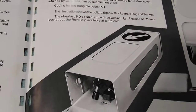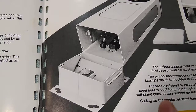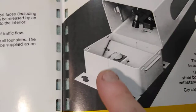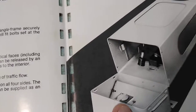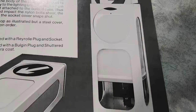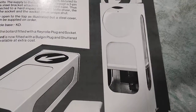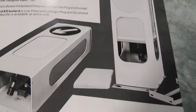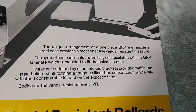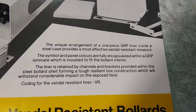This one pictured is a frangible bollard — the idea is that if traffic hits a base like this it should fall back. That there is one of those blue plugs I mentioned, which is something similar to this — it would snap shut and this cap here would close like a clam, sealing off the electrical supply. For those who don't remember these bollards, that's how they're basically constructed — things are slotted inside each other. The metal steel base is on the outside, everything slides in, and then the cap goes over the top. The GRP, which is glass reinforced plastic.